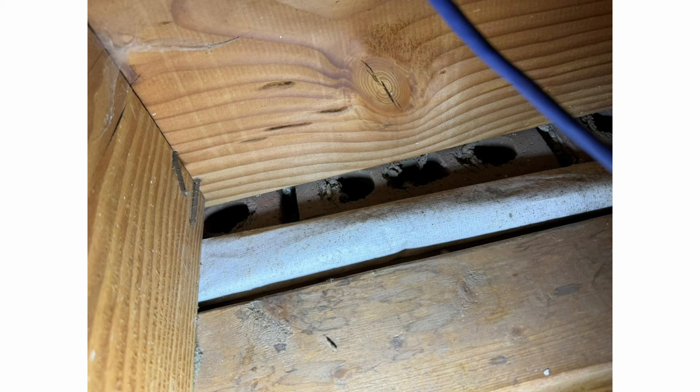The more concerning part is the mice coming into the house and nesting in the fiberglass insulation. Also, there is Tyvek wrapping the plywood sheathing between the plywood and the brick veneer, and the brick veneer has proper weep holes at the bottom. I'd like to seal this area for both problems. My thinking is to use steel wool — something like excluder rodent control fabric — to cover the gap on top of the brick to prevent the mice from coming through. Then air seal the rim joists with spray foam all the way down over the steel wool and top plate to lock the steel wool in place. My concern is around proper moisture management and how this will affect the plywood sheathing and the brick veneer. Are there any thoughts on how to best seal this to both air and rodents?